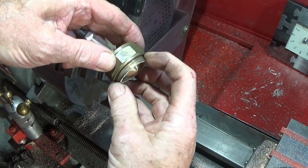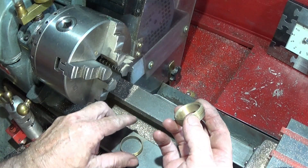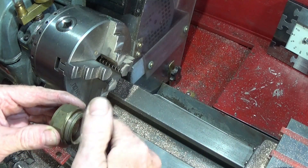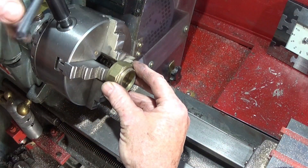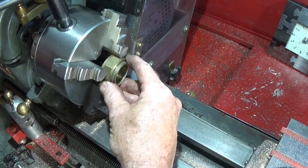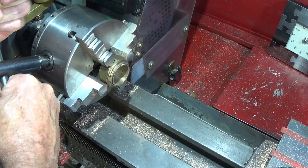But before it's finished, you've just got to put it into the jaws — the threaded part here. Keep the olive, put it back together with the nut. It can then be held in a four-jaw chuck being the octagonal shape, or in a three-jaw chuck if you have the hexagonal shaped ones. Grip that in the jaws and do that one up nice and tight.